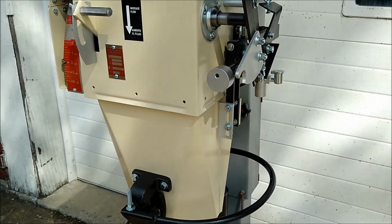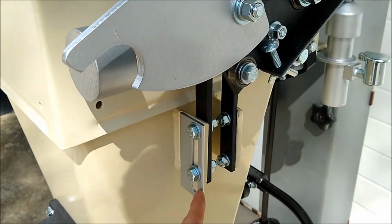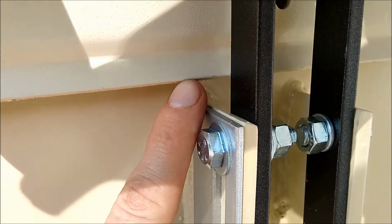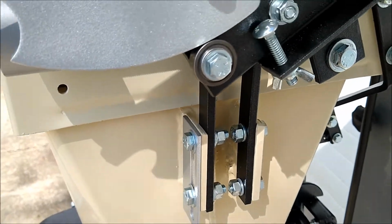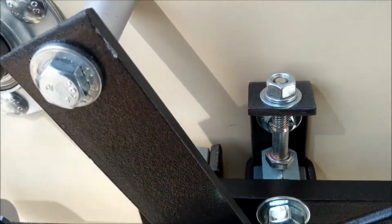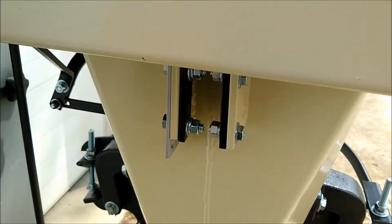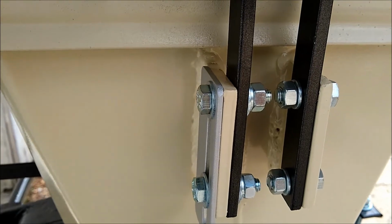If you just purchased the bagger, one of the things you should check is that these transport clips are lowered. When these baggers are shipped out, these nuts are loosened, these are raised and then relocked into position, locked up against this edge here, and this keeps excess vibration and damage from occurring to the V-block and the pivot, which the V-block is down there. Here's your pivot. These transport clips are located on this side, and also there's one on the other side of the unit. They should be lowered as you see them here before operation.